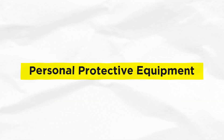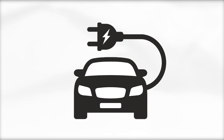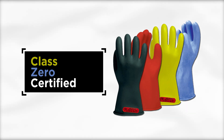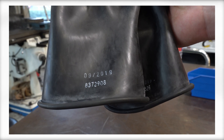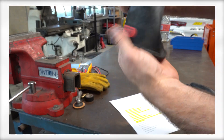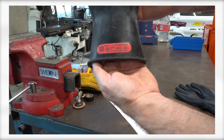PPE, or personal protective equipment, is crucial for the safe construction and maintenance of an EV. If the vehicle you are working on has even the smallest possibility of being energized, or if it has recently been de-energized, proper gloves and safety procedures must be followed. Gloves must be special Class 0 certified. The color of the gloves will vary, but the compliance decal on them is orange. There's a date on the gloves — they're good for 12 months from the original date of manufacture, and must be recertified every 6 months after opening the packaging and putting them into service.